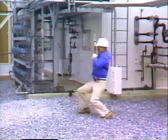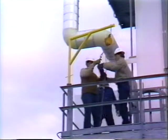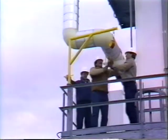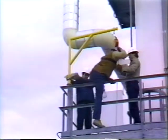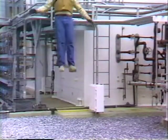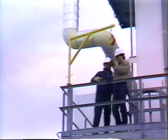This is demonstrated here with the one person reaching ground level and pulling the extra few feet of cable through to bring the sling at the other end up to the man on the platform. When it is mounted for use in either rescue or escape operations, the cable again should be twice as long as the distance from the attachment point to the escape level. Then, for escape operations for a number of persons, it would be necessary for more cable to be pulled through to get the sling back up to succeeding persons.